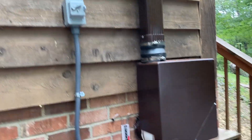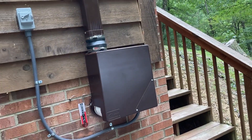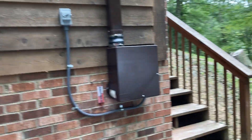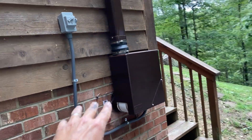You don't want the switch over six feet. This fan is made by Radon Away — it is the SF-180, which is comparable to the RP145. That really makes me sound intelligent, but what that's fancy speak for is a regular fan. We had a good gravel base underneath the slab, which calls for a regular fan.